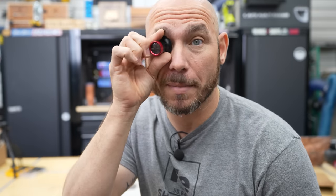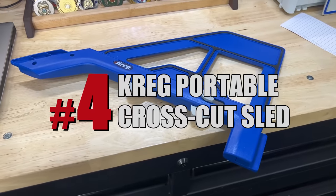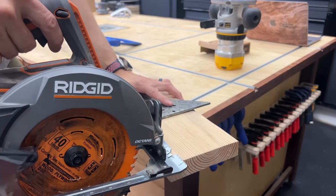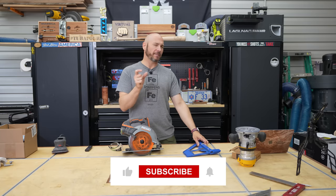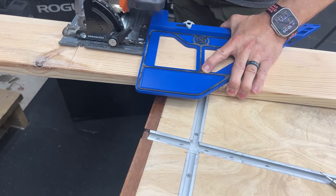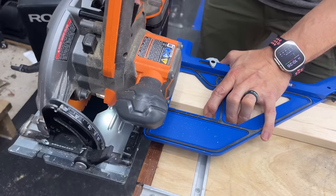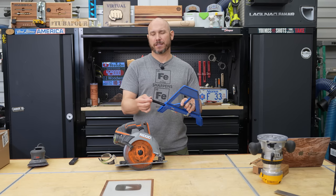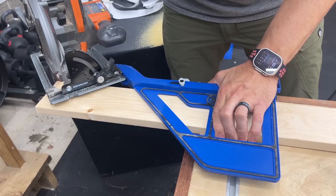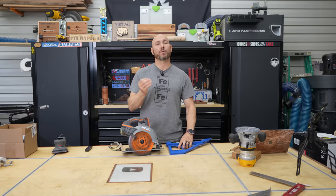You can throw this in a toolbox or a drawer — just super handy. Next up is the Kreg portable cross cut jig. This is a handy little tool. If you don't have a cross cut sled, or if you've been old schooling it with a speed square to try to get square cuts, that works for fast setup but it leaves a little to skill. This will help you with that, especially if you're a beginner, because it gives you a guide starting out on the cut, helping square that saw up to the stock you're cutting. It even has a cut line indicator, though that little plastic thing that slides out is kind of gimmicky. But for cutting cross cuts square, including a 45 degree cross cut, this will work nicely.